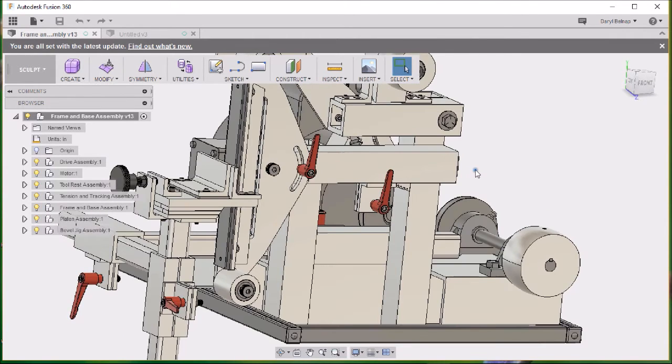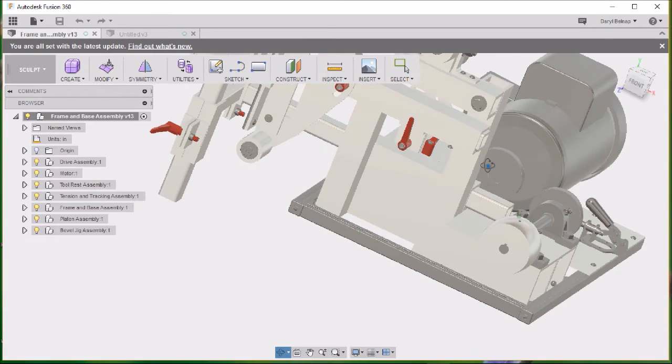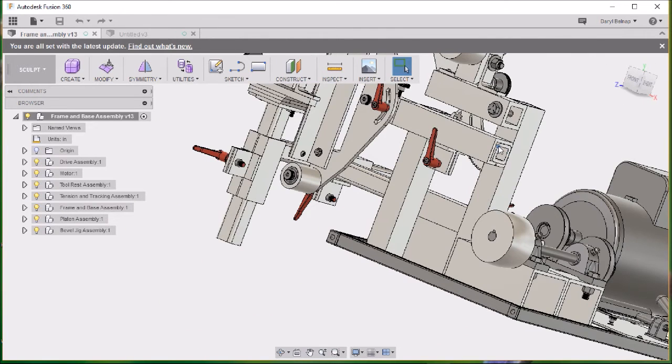Quite similar to the old one, except for some materials. This is going to be aluminum extrusion. I was walking through the store in Wichita, Kansas called the Yard Store, picking up some other materials, and I saw their aluminum extrusion. And I saw how tight the tolerance was, so I went over and looked at it, and it turns out that a piece of 1.5-inch square aluminum will fit perfectly inside of a 2-inch square with a 1/4-inch wall with no slop.